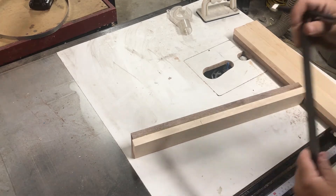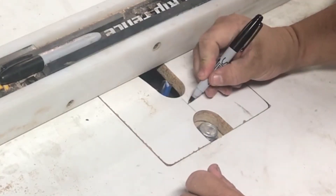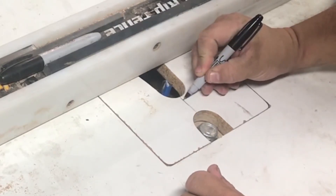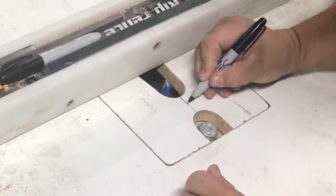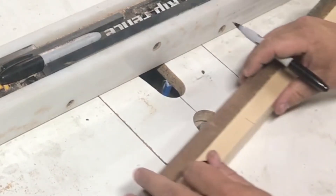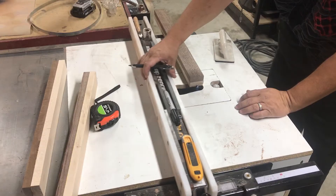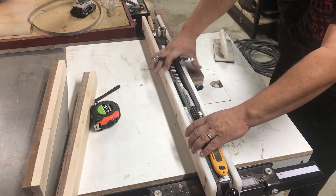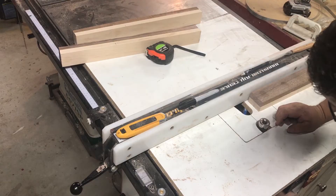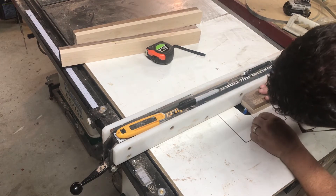The line that I'm drawing on the blank will match up with a center line that I have marked on my router. So when I go to cut my blank I'll line up those two lines and I'll know that I've gone deep enough into the blank. Then I'll just slide my table saw fence over to hit the center line of the blank so I can cut the slot in the center of the maple.